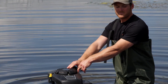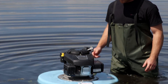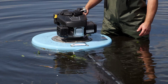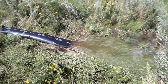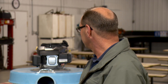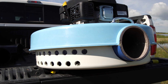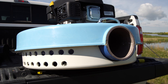The transmission on the Watermaster unit runs in an oil bath, so the pump won't get damaged if the water body runs dry. This means the farmer doesn't have to constantly be watching as the water level goes down. The oil bath will lubricate all the gears, and the engine has its own reservoir. It'll bring the water down to about the screen point, cavitate and get air, but it's still getting water to lubricate the bottom seal.